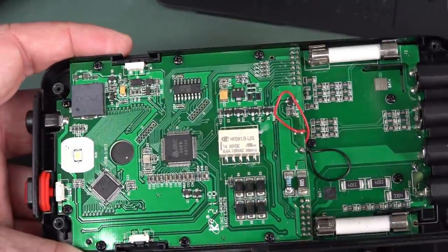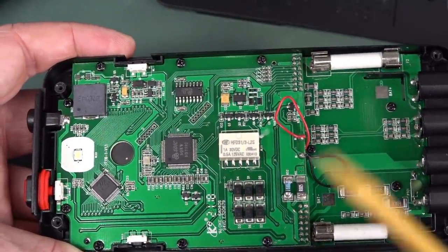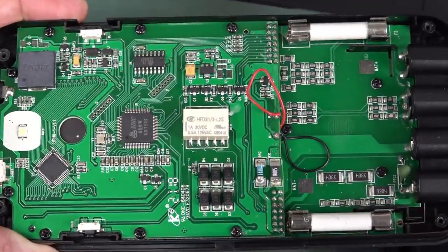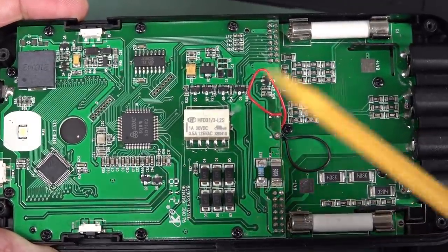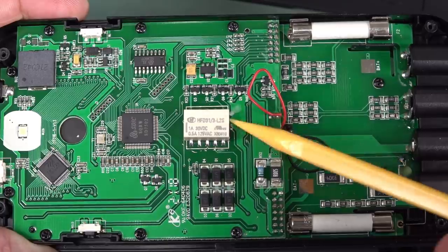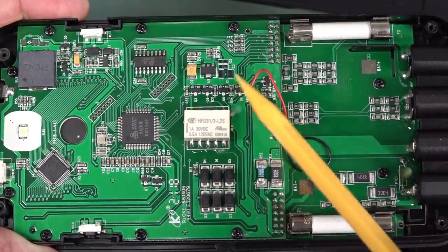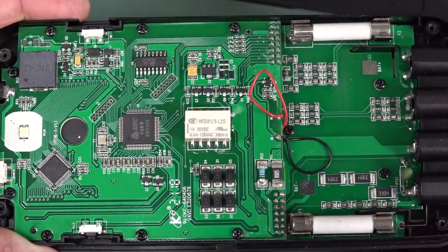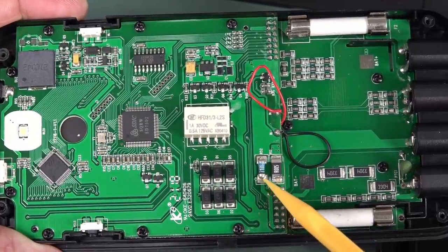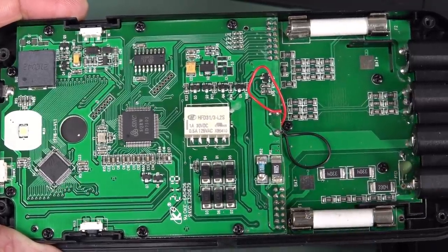But anyway, relay, of course, yes, no worries. Got some big diode array there. What are they doing with the diode protection there? Bunch of trannies along there. I reckon they're, yeah, looks like relay driver. A couple of those might be protection as well, maybe. And that looks like our current shunt resistor, is it? And that's a protection diode by the looks of it.